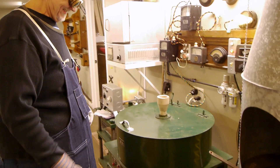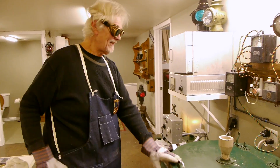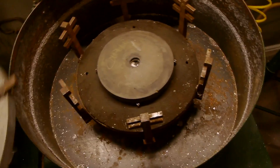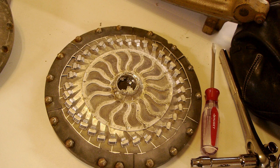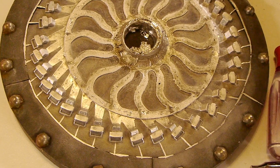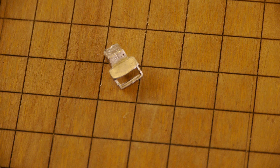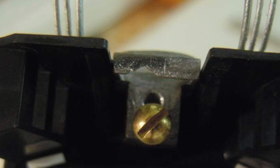Now you wait for the metal to cool in the machine — takes a few seconds, or a bit longer. The machine shuts itself off and you're ready to open it up, pull the mold apart, and see what you made. The first couple of times you throw a mold it's not uncommon for some castings to be flawed because the mold was ice cold when the hot metal hit it. But in this case it looks pretty darn good for a first throw — and keep in mind this is the first throw in 20 years. Here's the coupler pocket — that's what it's supposed to look like. It's packaged in little plastic bags, screwed to an Athearn locomotive, and it holds the KD coupler in place, and it really does a good job.